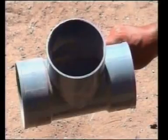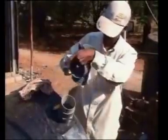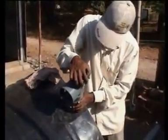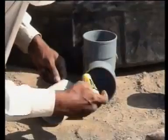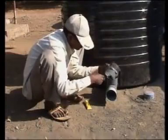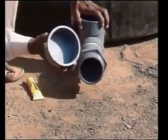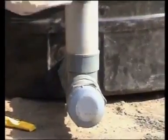Now take the 90mm tee and apply PVC adhesive to it on the inner surface, and fix it on this end of the 90mm pipe. All these pieces together should form a continuous linear horizontal pipe. Apply PVC adhesive to the internal surface of the free end of the tee and fix this piece of PVC pipe into it. Fix a male adaptor on this pipe with the threaded end projecting outwards. Fix an end cap on the threaded end. Fit a 120cm piece of the 90mm PVC pipe vertically into the tee piece like this.